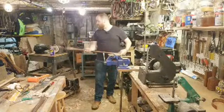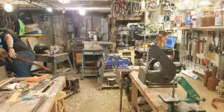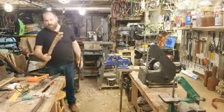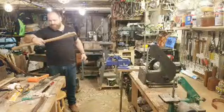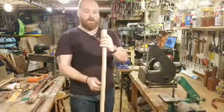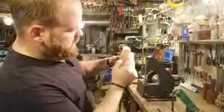So you can go to a hardware store and pick up a handle, but it's going to be pretty chunky, and a lot of times the grain is going to be pretty crappy. This is an Ames company handle. I'll go through and select ones. This actually has pretty decent grain. You might be able to see it. It's all running parallel with the handle. Good grain, which is the reason why I picked it up. But they're really chunky. If you look at this compared to this, this is almost half of the width. Maybe not all the way, but you just see how much.